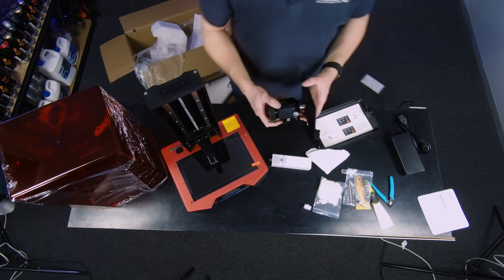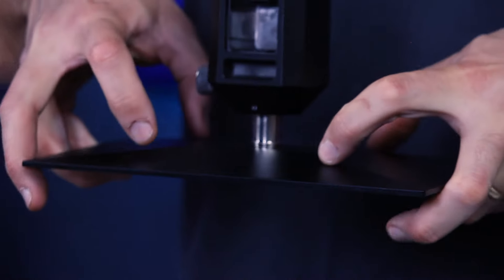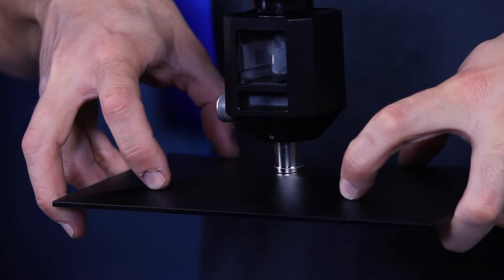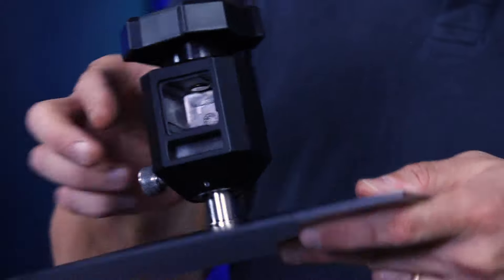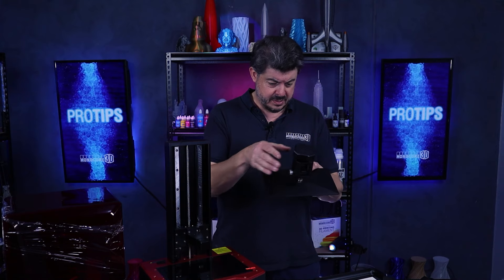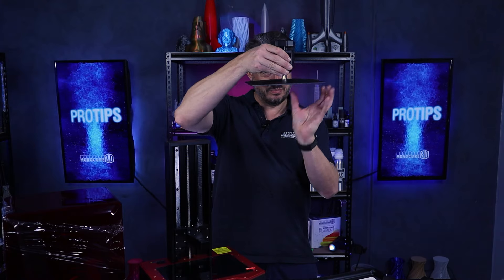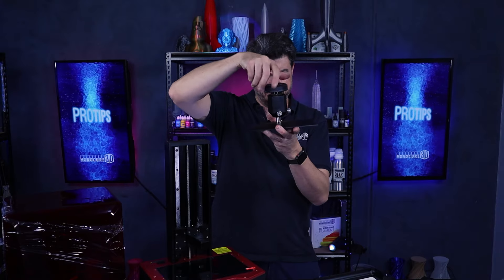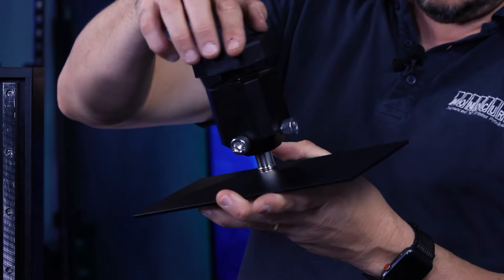Thanks Charlie. What a lot of gear! I'm going to have a look at this plate here with the big ball joint. When you think about it, all the other larger printers have their connection points further out, so it's less likely to move around. If they're going to keep rolling with this ball joint concept, they've had to scale it right up to prevent it from actually moving around, because if there's a model on one side of the plate pulling and pulling, eventually that plate's going to start tilting — so they've gone with hefty screws to make sure that doesn't happen.